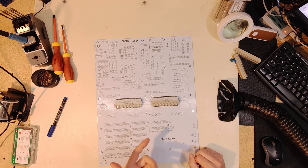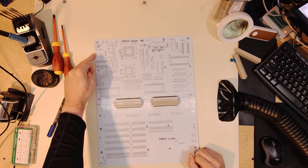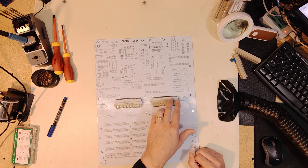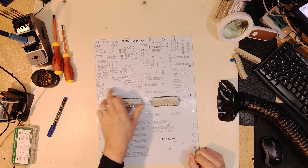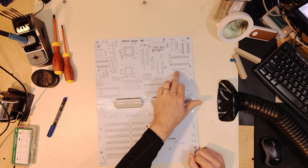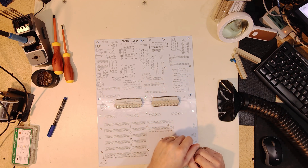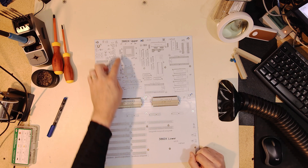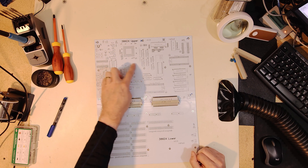As part of that I'll have power coming in with some banana plugs. I'll socket most everything - I'll put in my ZIF socket for the ROM, I'll put all these P-socks in sockets, RAM will go in sockets, etc. Now compared to the prototype board I was using before where I was doing all through-hole, in this one I want to start to move some of these smaller components to surface mount.